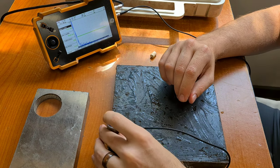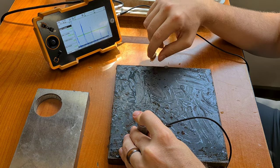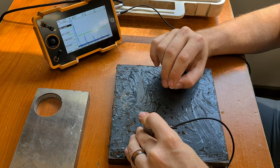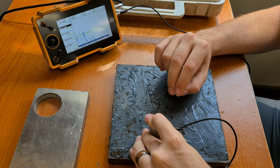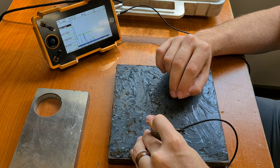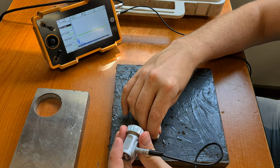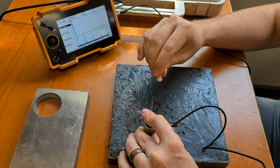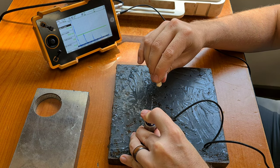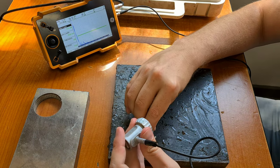Now to size it, they'll typically ask you to employ the sizing technique according to procedure. For the purpose of this we're just going to use the equalization technique. I look at my backwall echo and where it drops and the lamination echo comes up and they equalize, I will make a dot. I'll lift my probe up and in the center of where my probe was on the plate I make a little dot. I go just next to that dot and try to do the same thing.